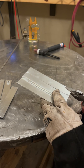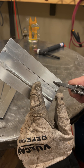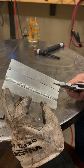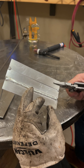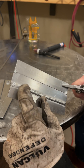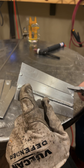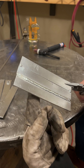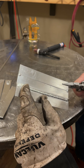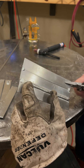If we look here, overall the width of it is pretty consistent. The start — not the best start but not bad. Very straight, very consistent. The end of the weld has a small crater, overall not too bad. Near the end you can see how it's a little bit wider and duller — that's because it got hotter and the penetration went through more. That was because the plate was warping on the table and didn't have a metal backing at that point. Overall pretty consistent.